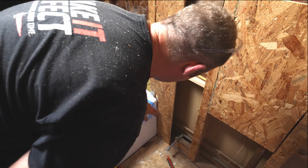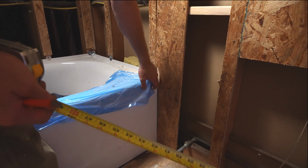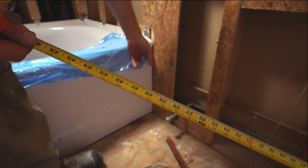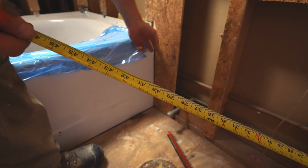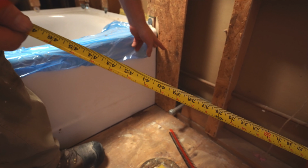But all I'm basically saying is, no matter what size your room is, I would recommend just allowing that waterproofing. You don't want to butt drywall straight up against the tub, because that's always an area where the drywall deteriorates when water runs down the side of the tub. So having the waterproofing board up against the tub is the best way to go.